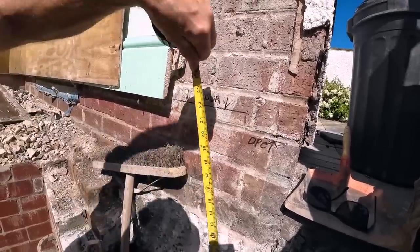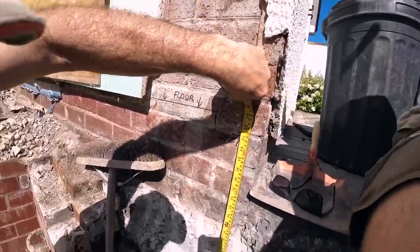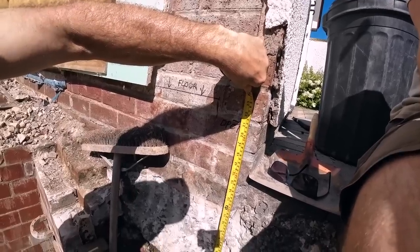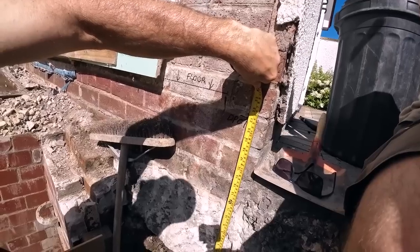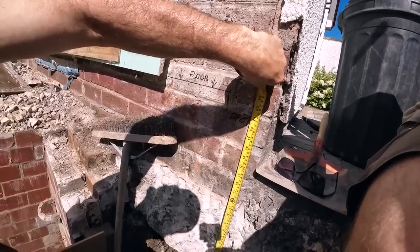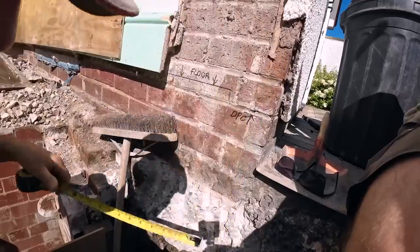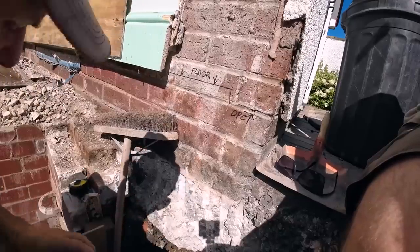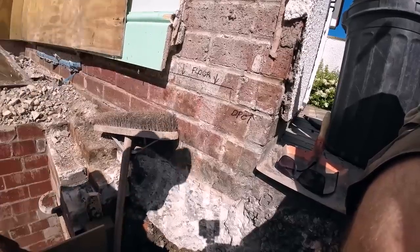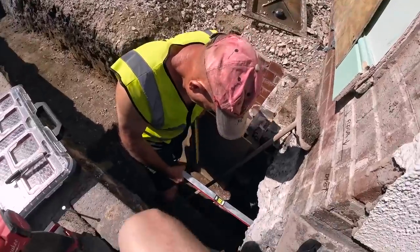Yeah. So we've worked our gauge out, which is 525 is a course of trench and 4 course of brick. So that's 225 plus 300. Now, I've set it at 21 inches, which gives us about 10 mil to play with. It makes the concrete 10 mil low, which is better low. You don't want to start cutting trench blocks. You don't want tight beds on trench blocks either. No.